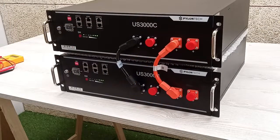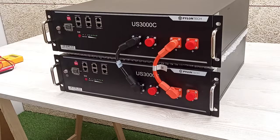Step 7. The balancing procedure will be finished when the run LED flashes on both modules. That tells us that the modules are on but the charge status shows nothing. This indicates that the battery is in sleep mode. When there is no load connected to the batteries causing them to discharge, they remain in sleep mode and do not show the charge status. Therefore it indicates that they are already correctly balanced.